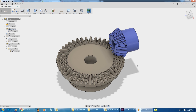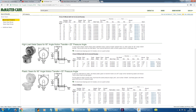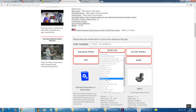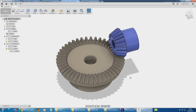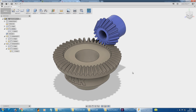It looks like I'm going to need some bevel gears, which I haven't used much in my 3D printed projects, just to keep those motors out of the way. In Fusion 360 you can import part numbers as a plug-in that allows you to import 3D files from McMaster-Carr, which is rather good. However, they don't have any mitre or bevel gears with different ratios - only one-to-one. So I found another website, KHK Stock Gears, which has a handy tool where you put a part number in, select any CAD format, and it generates the CAD file. I've got an 18-tooth gear and a 45-tooth gear as solid models, so I can scale them, change the hole size, or adjust them to fit bearings or grub screws.